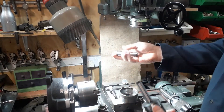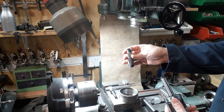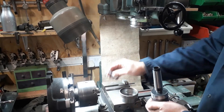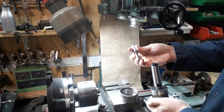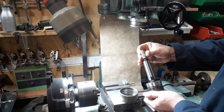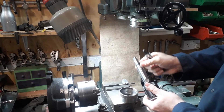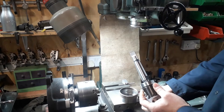So what I came up with is this idea. These sleeves are an open sleeve for drawbar — you can get them from places like IDG Tools or Euro Trade, anywhere like that. That leaves you with an open end, and what I made was this extended tang with the drawbar thread on it, which screws into the end there. You tighten it down with a spanner, which then pulls the sleeve onto the two Morse taper, locking it in, and gives the appropriate length for extraction later.